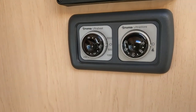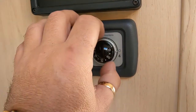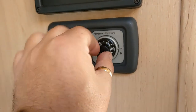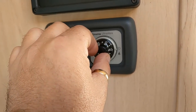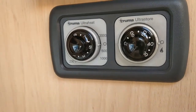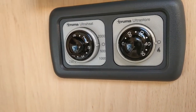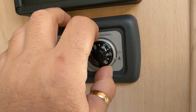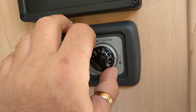You can still use the blown air with the electric if you want. This is your hot water — you select the temperature there. Most of us shower at around 40 degrees; at that setting it's using all the hot water without blending with cold. So you're certainly going to get 40 degrees if you're just heating up for a bowl of washing-up water. That's on, that's off — simple as that.